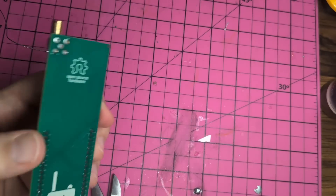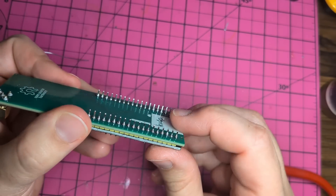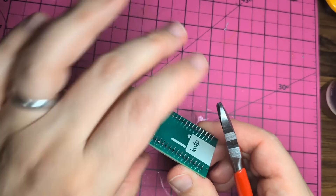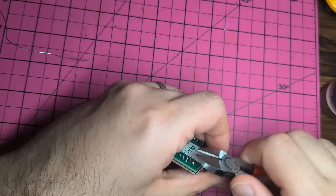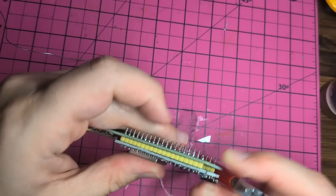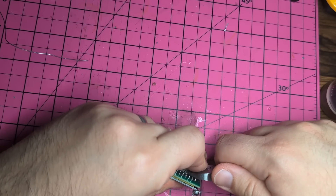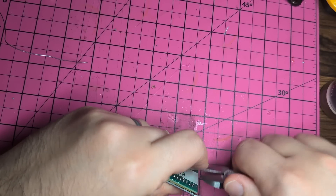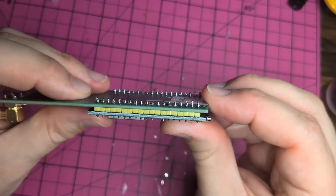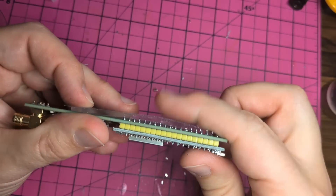So that's it — we have the circuit board all installed. Now this is an important part: these legs from the microcontroller, from the ESP32, need to be trimmed down as far as you can get them. Otherwise, they're going to poke into the back of your phone and prevent you from plugging things in. They like to go flying, so I like to cover it with my hand while I do this. Do you see how I snipped that down all the way down to the solder? As far as you can get it — that'll give you the most flexibility when attaching it to your phone. Those are nice and short. When we add the sticky gel pad to the back in just a moment, that will give us plenty of clearance from the phone.